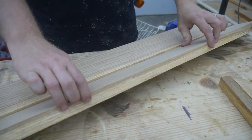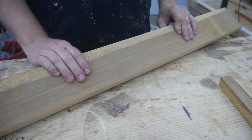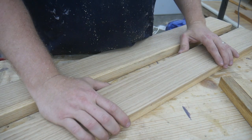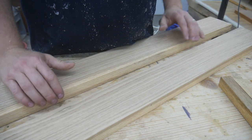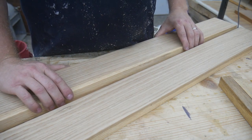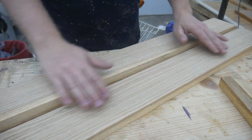All that's left on these boards is that we still have a rough face on the back side of the board, but I'll address that after the glue-up, because these boards are one inch thick each and I'm trying to get a one and a half inch thick piece of stock out of this. So now I'm going to glue it up.